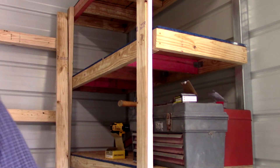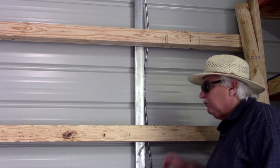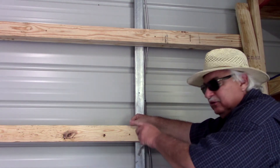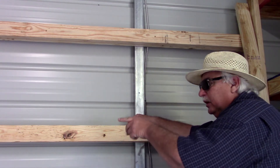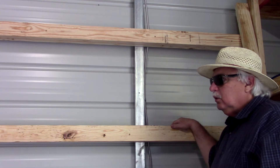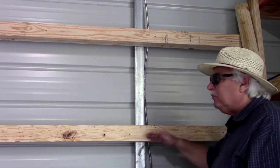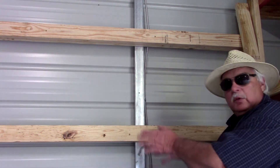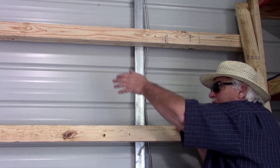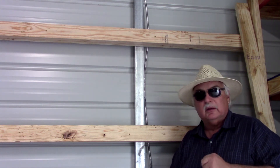Let me show you this back wall here. Because I have a deep freezer right here, we're not going to come as low as with the first shelf project I did. We're coming up a little bit, and there's only going to be two shelves here. Closer to the window on that west side, we're going to have one low shelf, just keeping the freezer clear. That way everything is going to be uniform — nothing in the way. I put my two runners up here and my two outside runners attached so I can keep it level. I'm going to attach the legs, bring it out 24 inches wide, and all I'll have to do is put my ribs on both shelves and deck. That's the update on the shelf project in the garage.